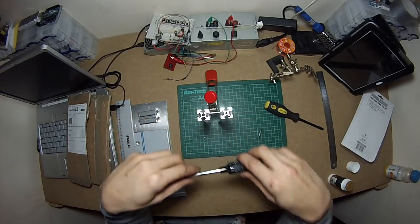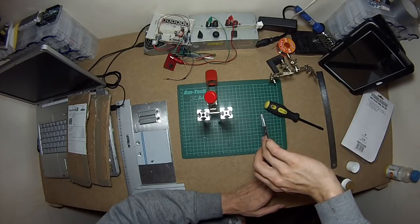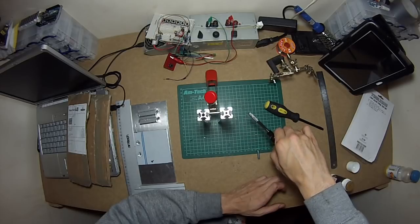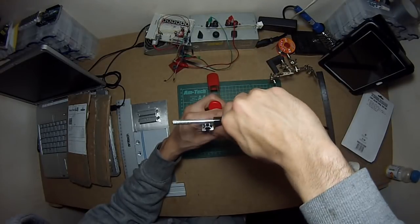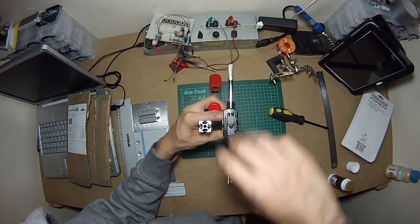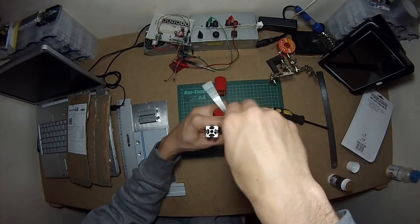Put the tapping tool in as if you're putting in a normal screw — eventually it bites a bit and starts cutting a new thread. As soon as it bites in, turn back straight away and it'll be loose. Then go forward again until it goes stiff as you cut a little bit further, then go back again. Don't be tempted to keep cutting in one direction. Just keep going — same forward-and-back process. Just have a go and you'll be able to do it.